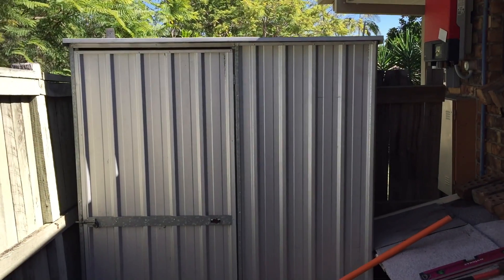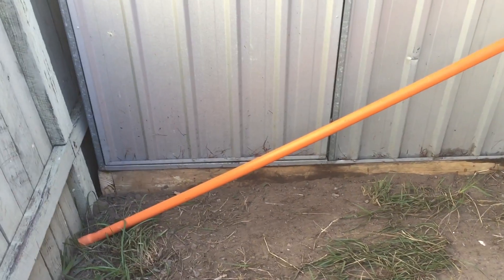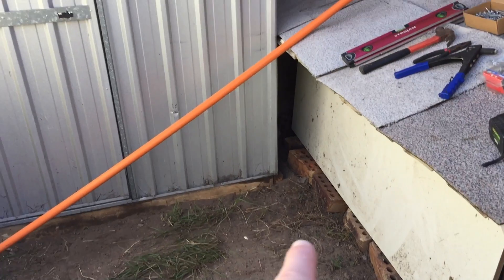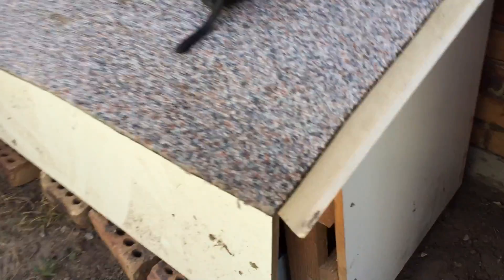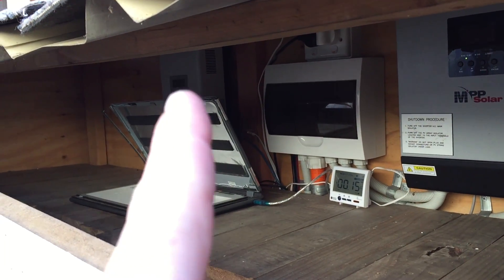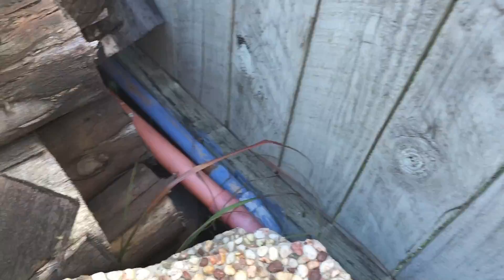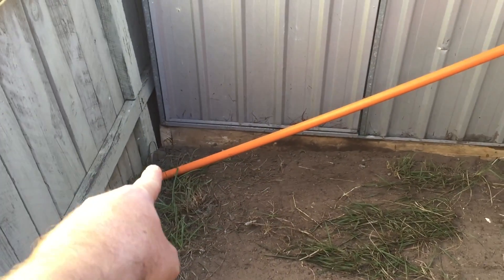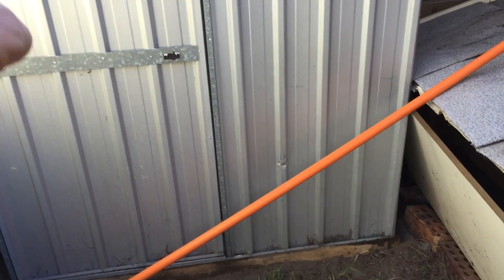This morning I've been moving this shed into place. I've got some railway sleeper offcuts dug into the ground to make a level base — it'll have sand and concrete in there in the next week or so. Basically, the plan is to move the PCM 60x charge controller into the shed on that wall. Behind the wood pile there, that orange conduit comes over and is dug underneath the ground, so I'm going to dig that up and run it along the fence underneath the ground, then up the wall — that's where the power will come in.